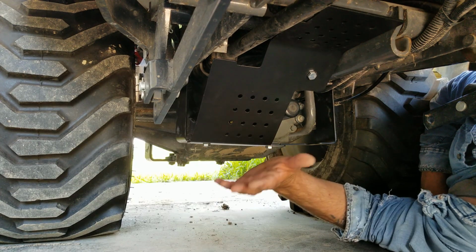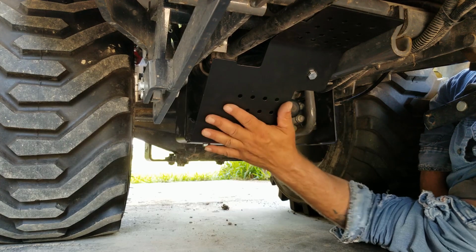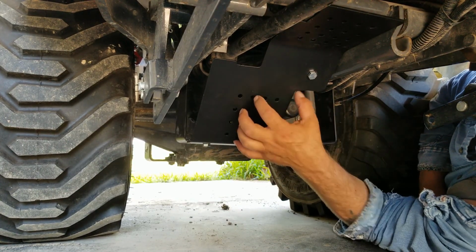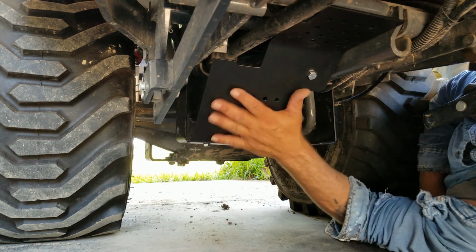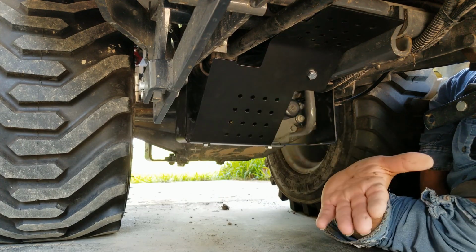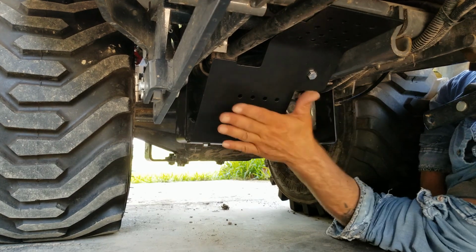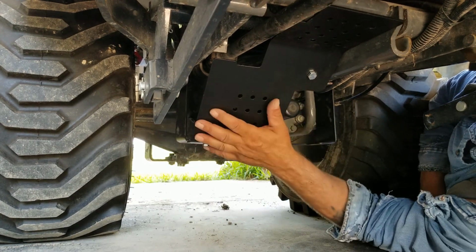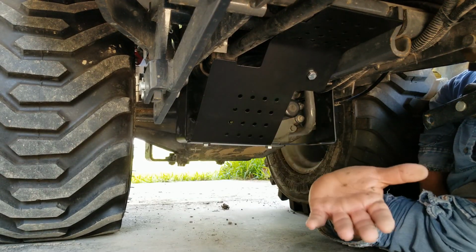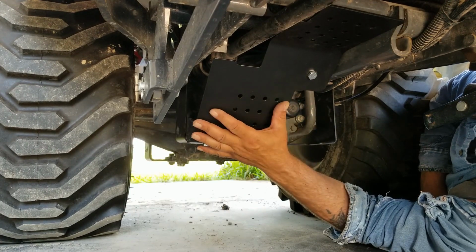It shortens its life. So when you're running a shield of any kind, you've got an airflow restriction. I don't care how many holes they put in it. Other than just being wide open, it's a restriction. So when you're running a shield, you make sure you run this tractor more now than ever at its proper working RPM, or you're going to sacrifice your pumps, you're going to sacrifice your rear end. It's going to kill it way before it's time.